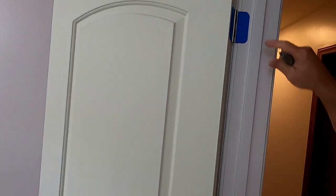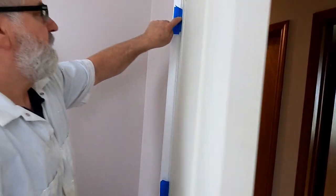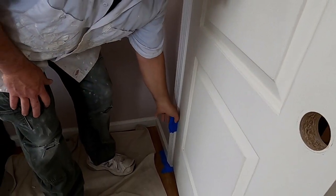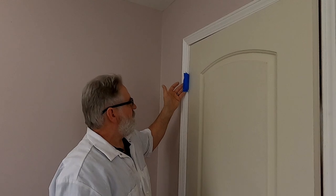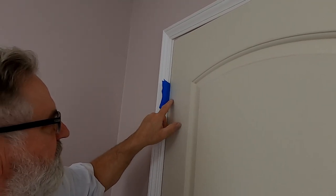It just helps so when I'm using a brush, I don't have to be as careful around these hinges. I got the hinges taped off on both sides — on the back and on the face — just where I'm going to use a brush and roller. Now, if you were going to spray these doors, which most painters would do, but if you don't have a sprayer and you're going to use a brush and roller as I'm going to do, you could be careful enough not to tape these off. But I tape them off because it's easier, and I'm going to paint it in place.